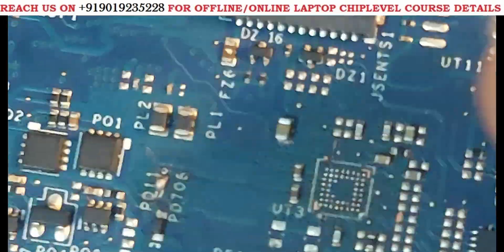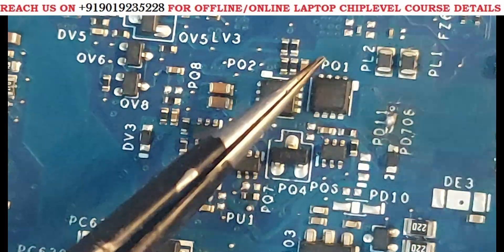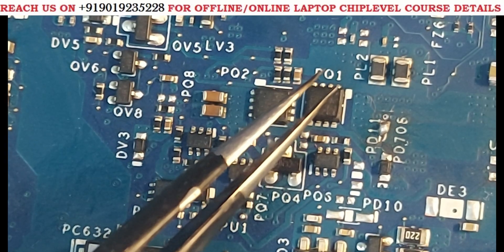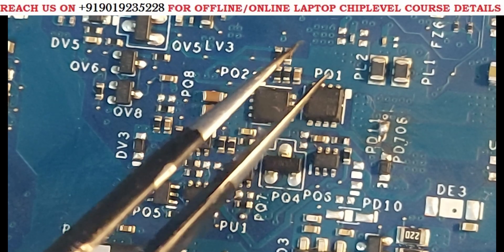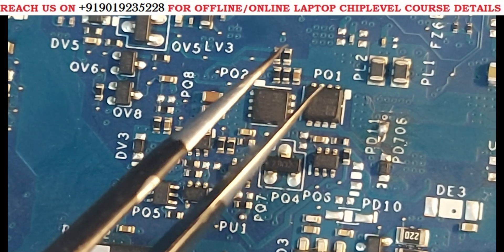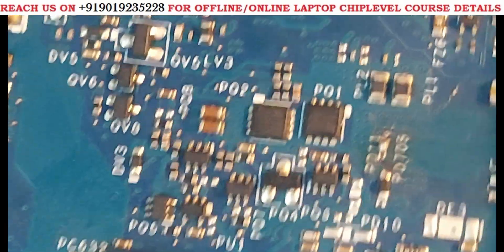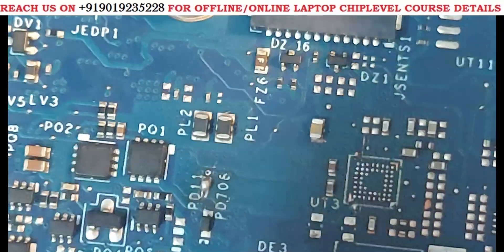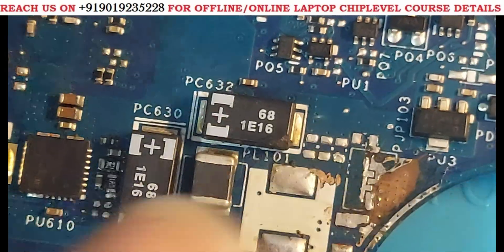The good news was we found one problem. But the reason for the 35 impedance is that the previous person had injected voltage into the 5 volt section, and instead of zero — meaning a complete short — it damaged some internal ICs. The internal track was short but not completely to zero. This is why it's very difficult to find — in a completely zero short we can identify exactly which IC or component is the problem.